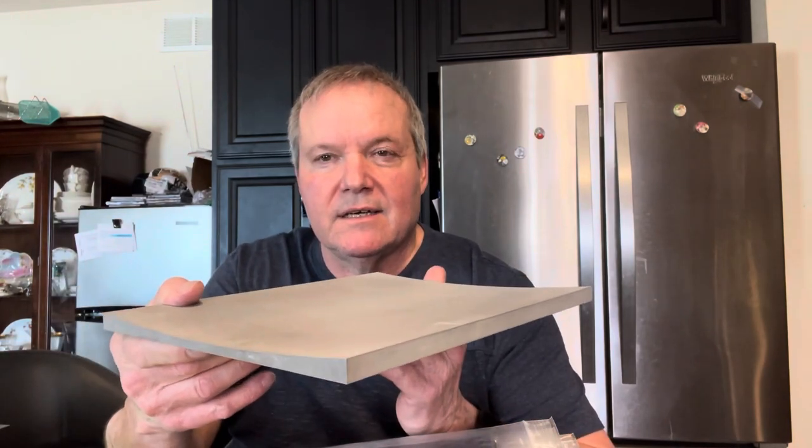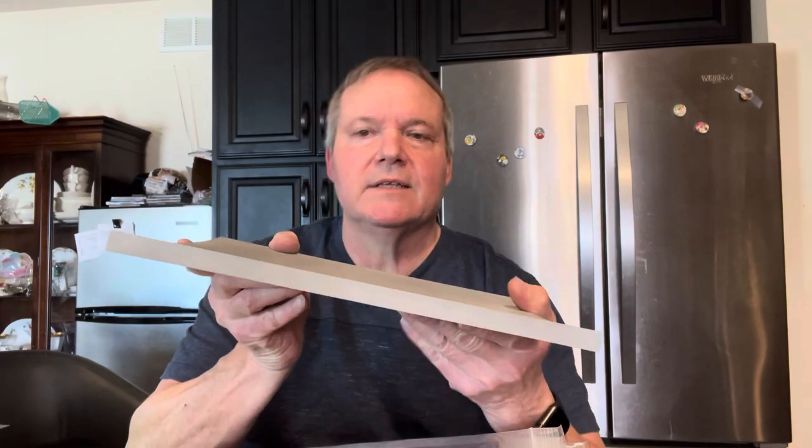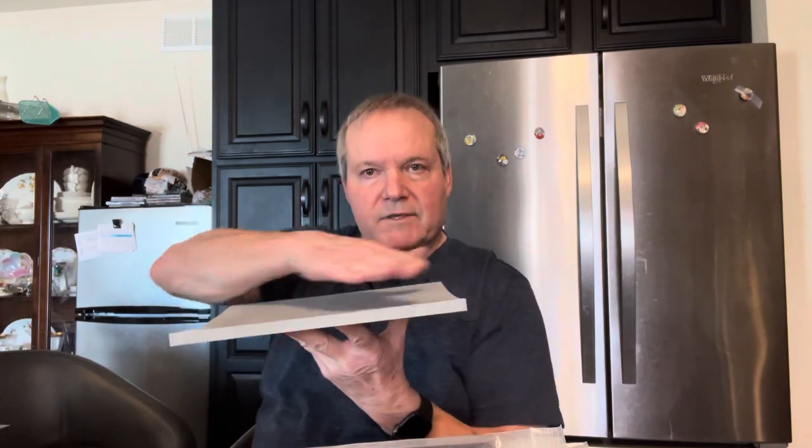Now you don't need this — I have shaped stones by hand. You can hand-shape stones. I'm sure in the 1840s when they were doing that, they did not have a machined aluminum plate to put sandpaper on and rub stones on. I call this the Jared plate because it was his invention. This is an aluminum CNC-machined plate with a compounded curvature — in this direction the curvature of a 24-foot wheel, and across being the curvature of a 6-foot wheel, leaving you with a stone shape that actually has an elliptical crown.